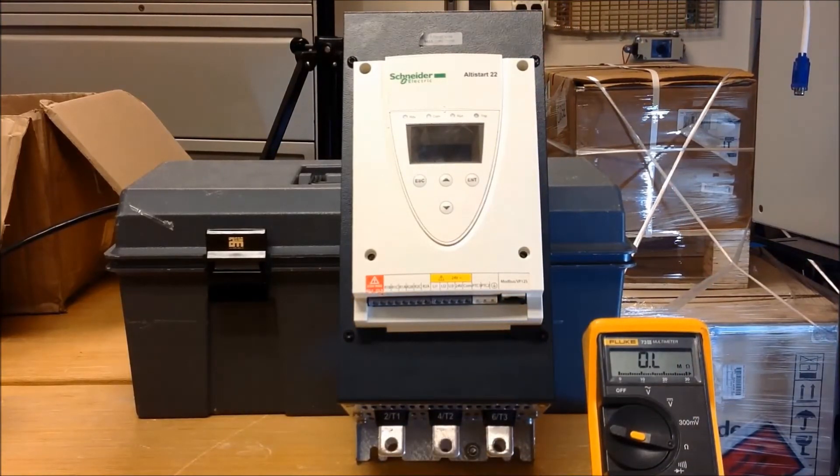In most cases, the minimum ohm value we're expecting for these SCRs is 50K, but a normal value will range up to even 200K ohms if necessary.